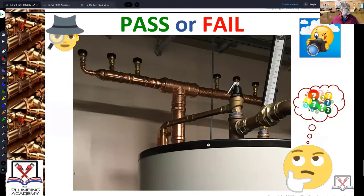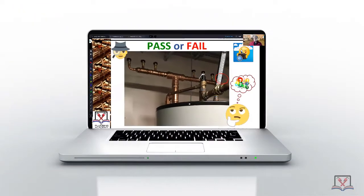I believe those are all half inch, and it looks like it was two inch. So he was down one pipe diameter — inch and a half. If you've never seen it before, if you're looking at large capacity storage tanks and you're working with people and they're not doing this, they're not complying with the code.